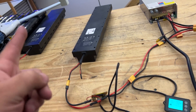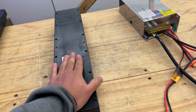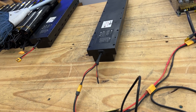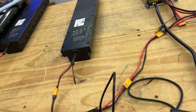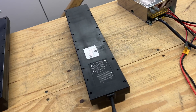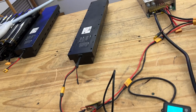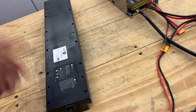The reason it stopped at 85 percent is because the BMS turned itself off — it hit a low enough voltage to trigger the shutoff. There was about 1.75 amp hours left, so we got about 11 amp hours out of the 12.8. That's roughly 396 watt hours out of the total 460 watt hours.